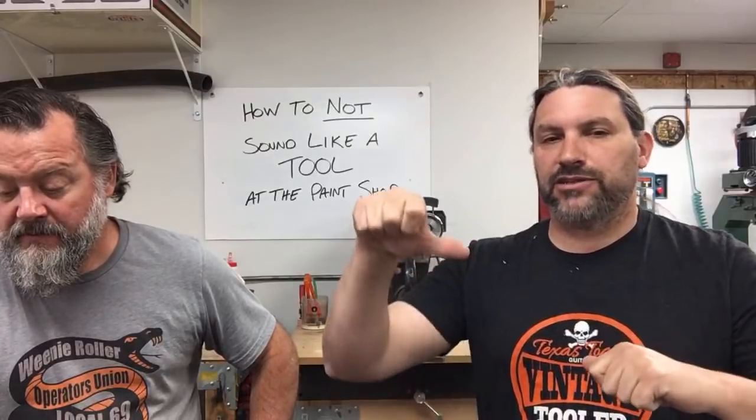So if you say I got my body ready to go with Simtek Easy Sanding Sealer 2850, now I want to put a sunburst on it, I'm going to mix my Trans Tint, which I got from Jeff at Trans Tint or from Stumac, with my DBC 500, which is also known by other names from other brands as Color Blender, Mid Coat Clear, Intermediate Clear. There's all sorts of things it could be, and you can use it just like you would with lacquer. Then you get that on there, do your sunburst, and you're like, wow, that looks cool, man. Now what do I do? Now you go out and you get clear.